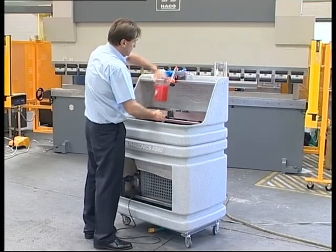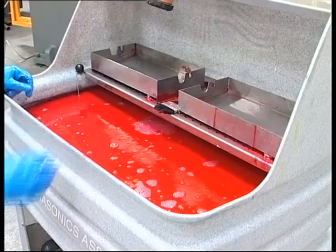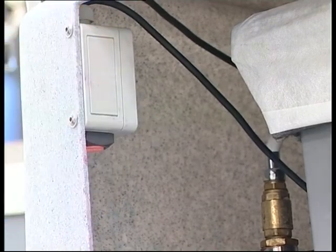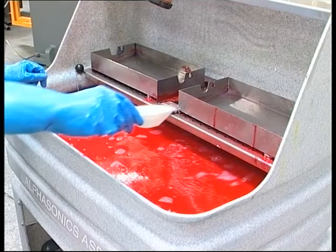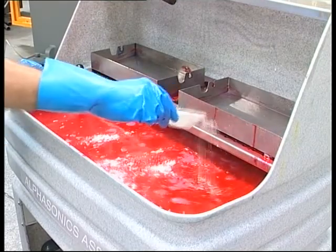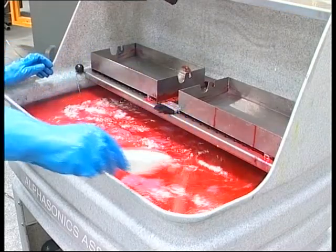The contaminated water is first agitated via a stirrer operated by a simple switch. The agitator is set to a 10-minute cycle or a manual operation cutoff. Once the agitator is switched on, the flocculation powder or fluid is gradually added.